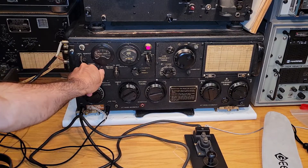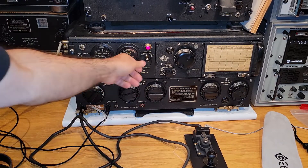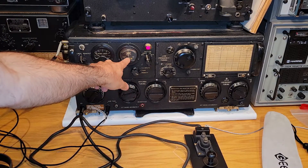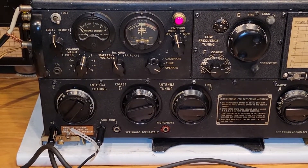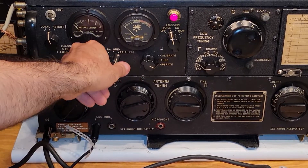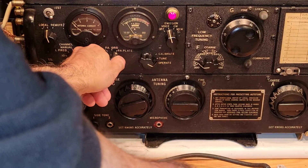Let's set it back and watch it auto-tune one more time. There you have it. Now let's take a look at the meter. Battery voltage is fine — hopefully you can see that. But the PA grid and the plate show nothing. Even when I key up, there's a little bit of juice but not much.